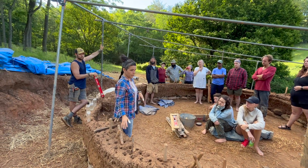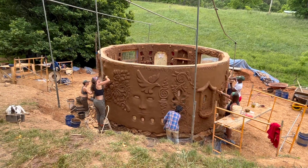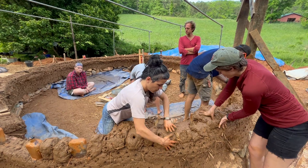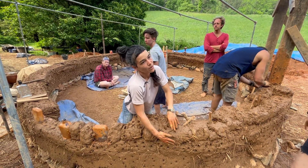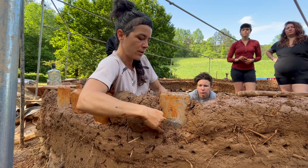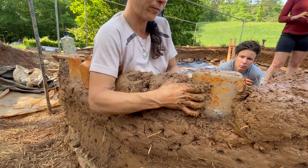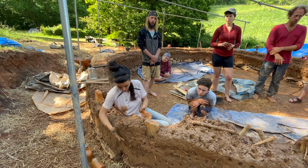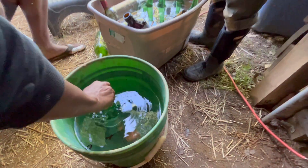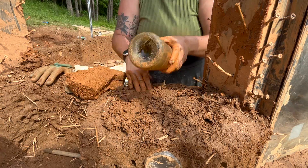On the morning of day 10 we continued discussing design elements and installed our first set of bottle bricks in the cob wall. Embedding glass bottles into the walls is a beautiful way to allow natural light into the home. You first plan out your design for bottle placement, then coat each bottle in clay slip to help bond it to the cob wall, and shape the cob to grip the bottle on all sides. We used whole bottles and also created cylindrical bottle bricks by cutting and taping two bottles together, installing them the same way.